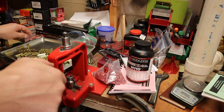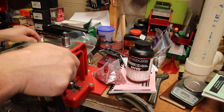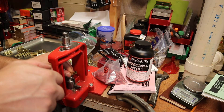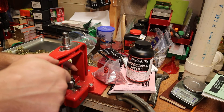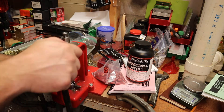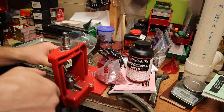If you're just starting out, this might be a major task and you might get frustrated, so just do one step at a time. Go ahead and throw your brass in the tumbler — or if you have an ultrasonic or pin tumbler, whatever you've got — and get your brass all prepped one day. Then the next day come in and deprime and size. Maybe then trim to length, and then come in and do your powder and everything else.